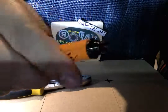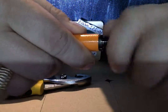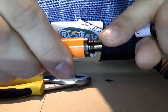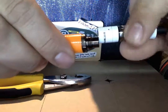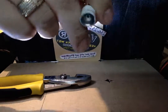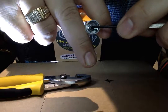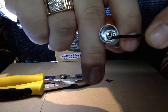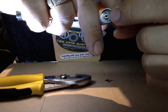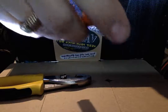When we hit our button, we're sending power to the tip here. Your tank, where you screw it in, goes right over this piece. This is your 510 thread, and your 510 thread tank screws right onto here. Around your tank, the side piece that screws onto your battery is the negative. The very tip of your coil — that's your positive. Your coil is screwed in around the negative, and the very center of your coil is how, when you hit your battery, you're getting power to it — positive and negative.